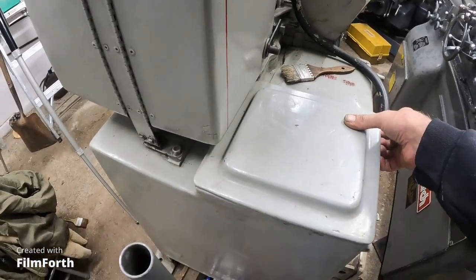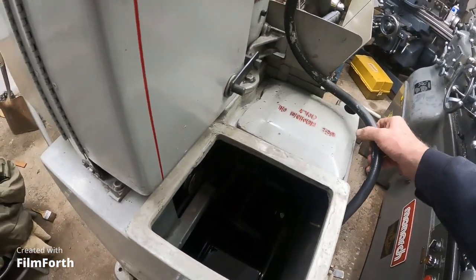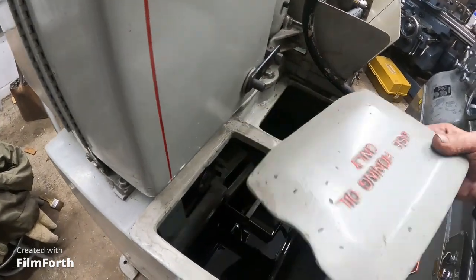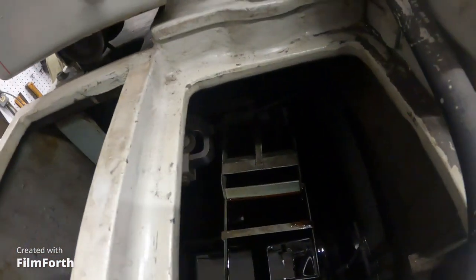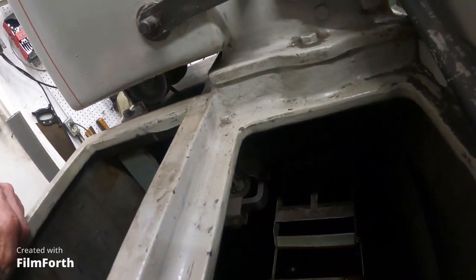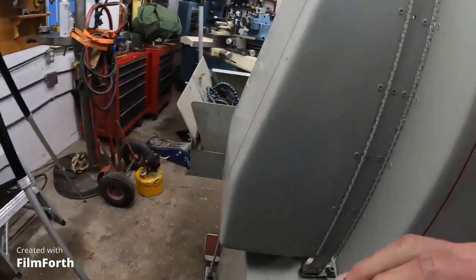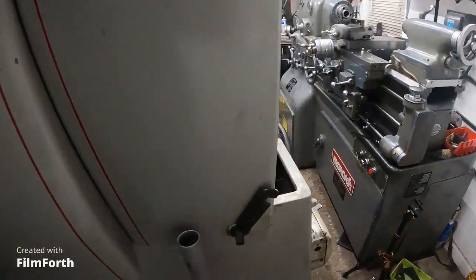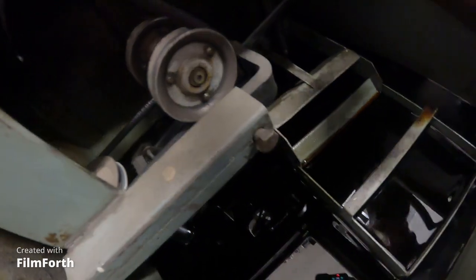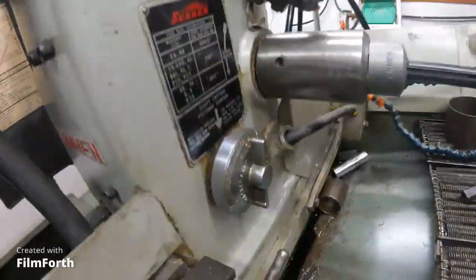It's got a tank inside here. Pull the covers off. And it says use honing oil only. And you probably should — I use Sunnen honing oil, MB-30 I think it is. Now this thing has an oil pump. Let me loosen the other side; you can loosen both sides, maybe get a little more light in there. Kind of a fiberglass cover. But it holds 15 gallons. And here's the settling tanks here, these two tanks. The oil drains through the tube here in the tray down into this first tank.